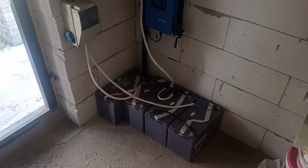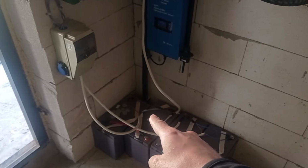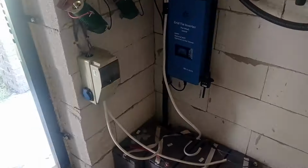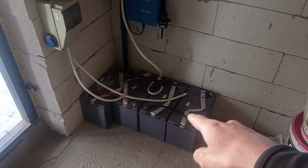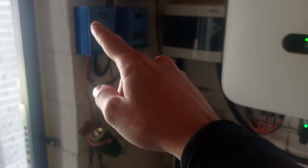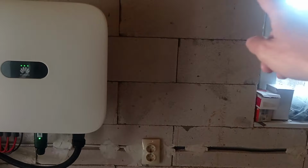And what I want instead is to put the diesel generator into the batteries, because here I have this gel battery pack, and there is my hybrid inverter Deye with the lithium iron phosphate LiFePO4 battery pack, which is so much better for high currents, for storing the charge, and for cycles, whatever. This pack works as a transfer pack currently, and my idea is to take out the solar panels, put them in series, and mount here a small inverter, which will be a 48 volt one.